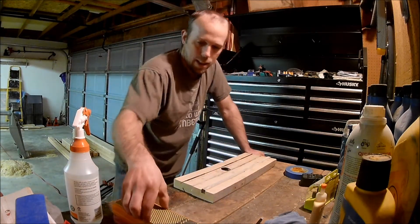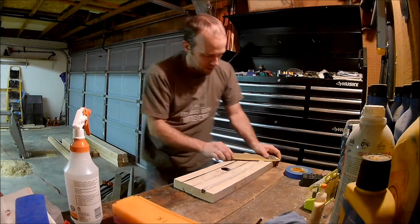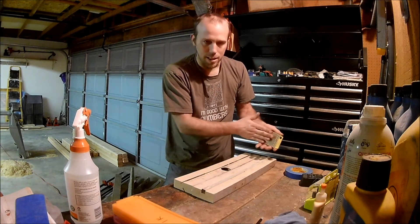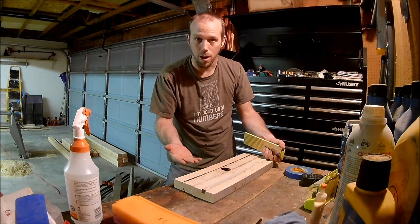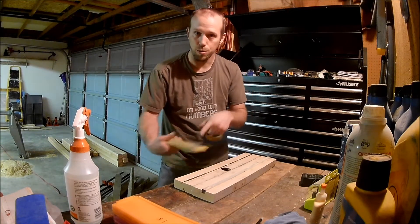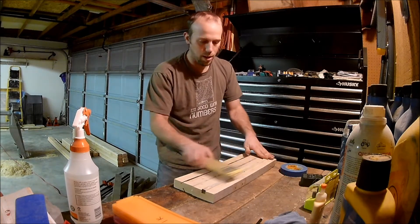The way I use this: you have two options. You can put tape on this support here and move your sharpening stone over your blades. But if you put tape on here, it will eventually wear through depending on how long you have to work and how much material you have to remove. What I've found works best is painter's tape. I usually just wrap the back half — whichever half I'm not going to be using to sharpen the blades — and then the abrasive of the sharpening stone isn't wearing through the tape.